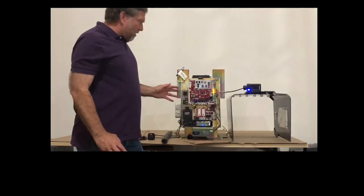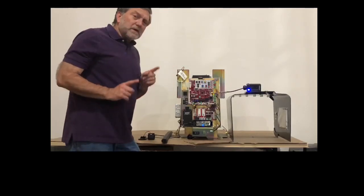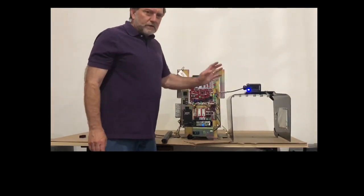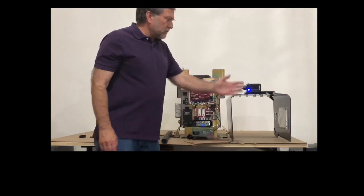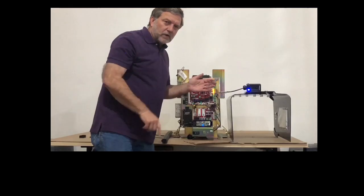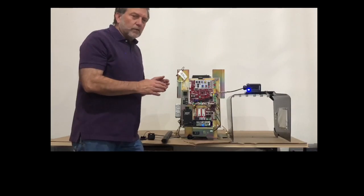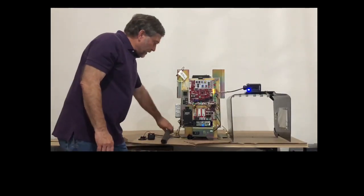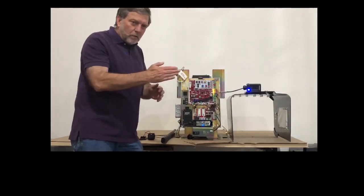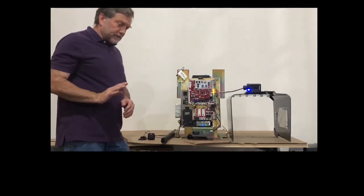All right, so now we still have our lights blinking. There's still something wrong here. So we need to make sure, since this system requires one monitored device for when the gate is running in the closed direction, well, the photo eye fulfills that. So you should have the photo eye shooting its light beam across the driveway. The second monitored device that's required is one for when the gate's opening. That's why we put the rubber edge on the back of the gate, so as the gate's running open, if that rubber edge contacts something, it will cause the gate to reverse.